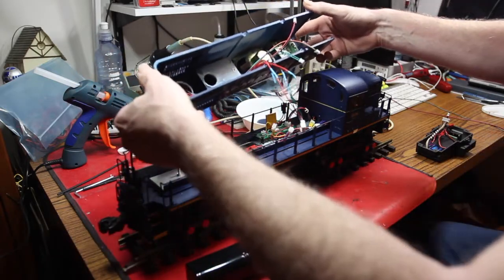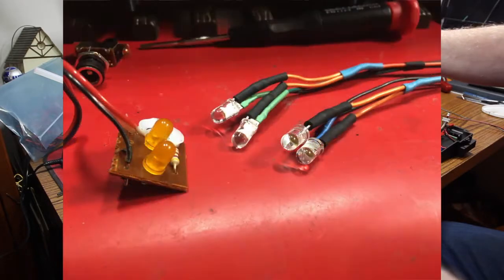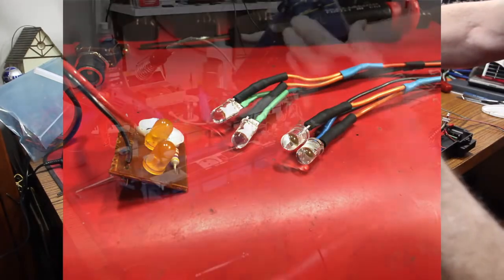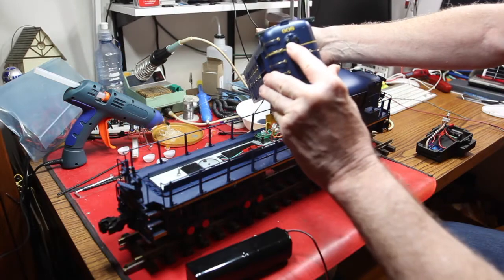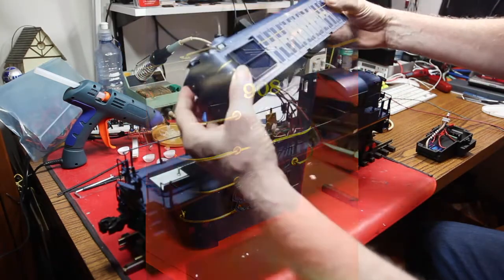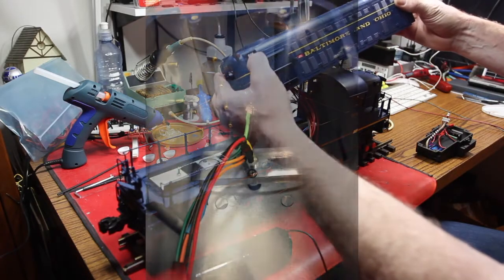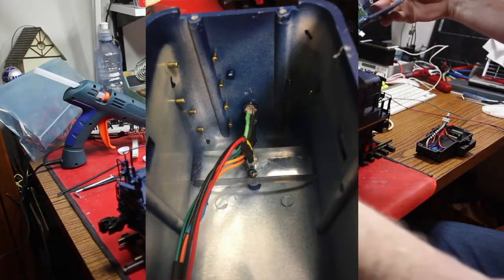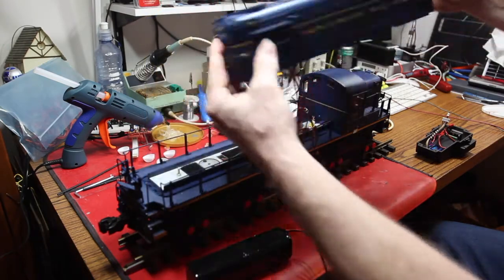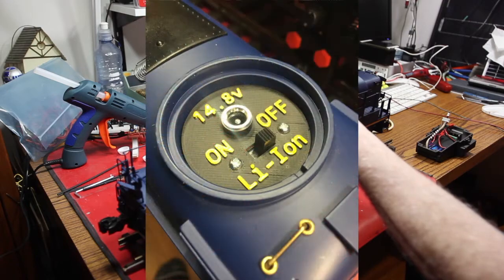The original headlights were seriously lame — they were just simulations of headlights, not designed to make any real light. So I've gone ahead and replaced the LEDs up here. In addition, there was a rice grain bulb running the running lights; I replaced that with an LED as well. All the charging jack stuff goes to a nice little 3D-printed panel that's hidden where there used to be ventilation.